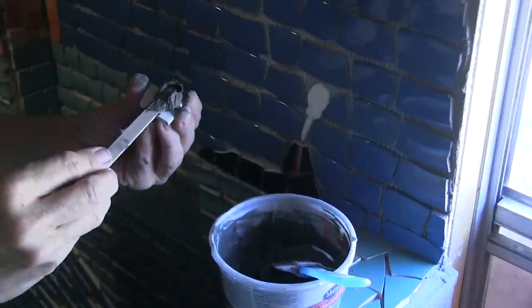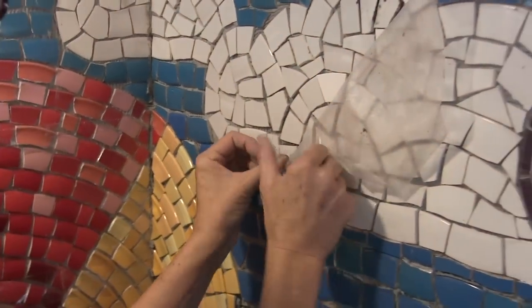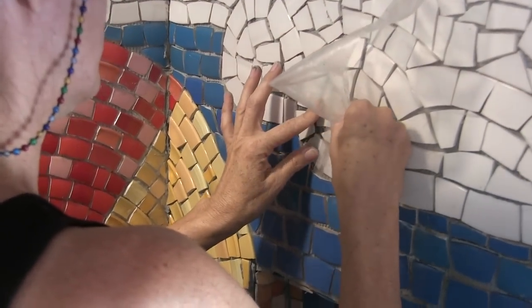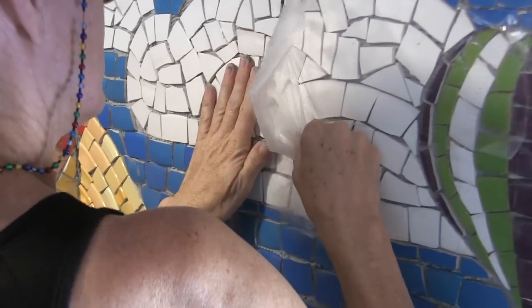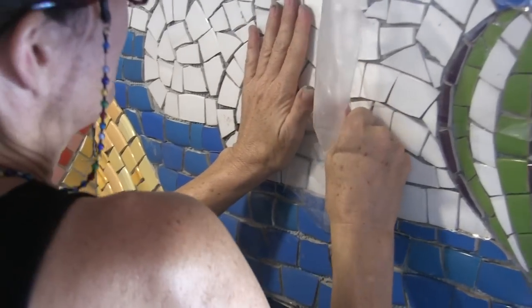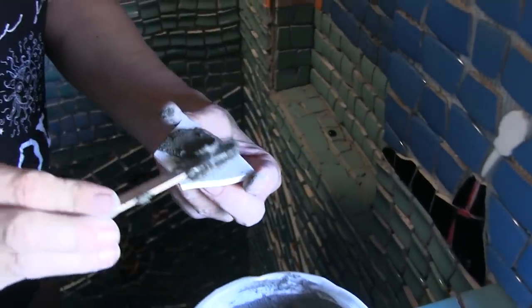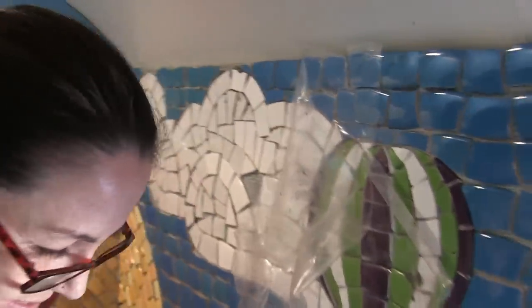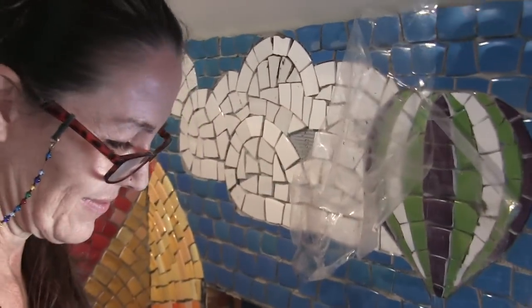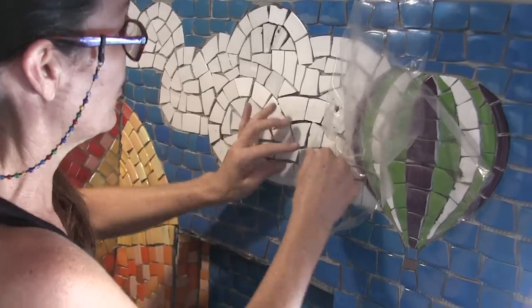The thinset consistency is really good. Looking at the back of that loose tile, none of the thinset was touching it — so it's not that we did a bad job. It's just that in some places the thinset dried before we could get the tile onto it. That's what you get building in Arizona.